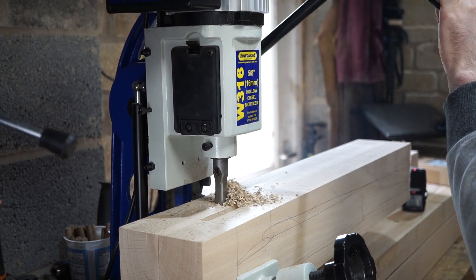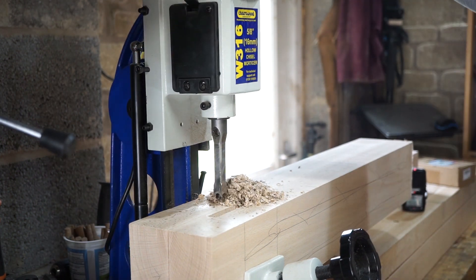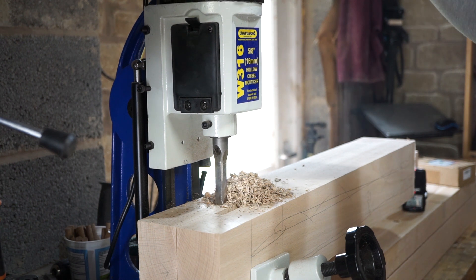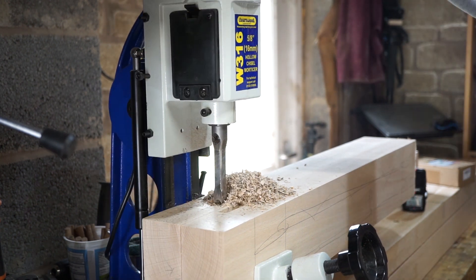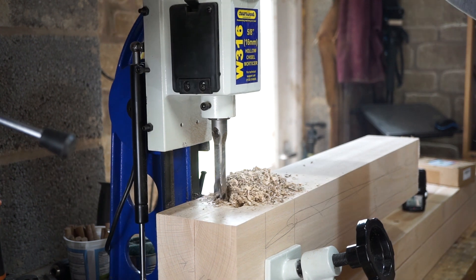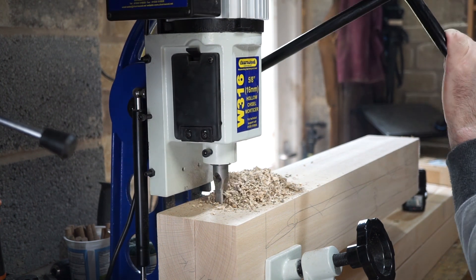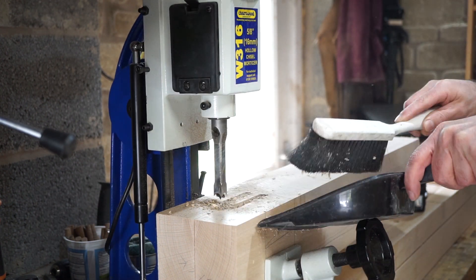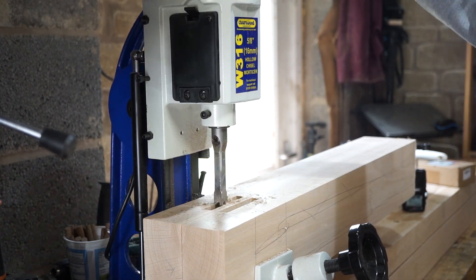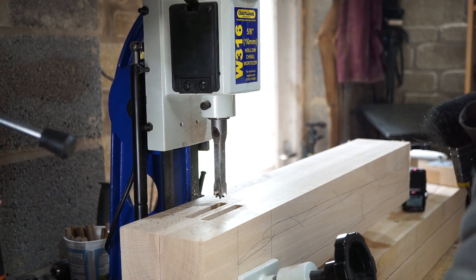On to the mortising. I enjoy cutting joinery by hand most of the time, particularly dovetails, but I hate cutting mortises for some reason — I don't like cutting them by hand and I don't like cutting them with a router either. Thankfully my wife bought me this Charnwood mortiser as a present, and whilst cutting a load of very large mortises still isn't quick or fun, this certainly took the sting out of it. I'm using a half inch chisel here, which is fairly hefty, and the secret is to go slow with consistent pressure. If you try to go too fast or apply varying pressure, the chisel blocks up and you have to stop the machine to clear it. The smaller chisels work much better and cutting standard furniture-sized mortises with this is very quick and very easy.